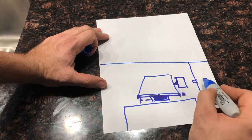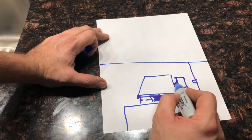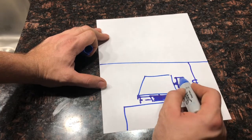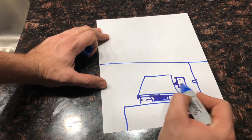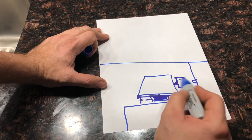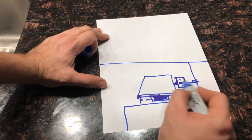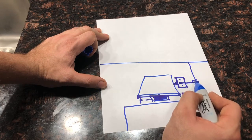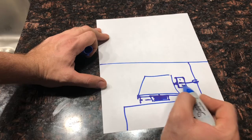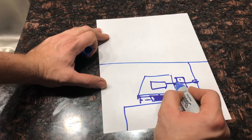And then at that point, to get the measurement, I got the 3 inches here, but I also wanted to find out where it was going to be placed with the speaker. There's two mounting points, and they're kind of off-centered for the height and the base. So I measured on the speaker, got the center line there, and had that center line match up. Then I added up where the speaker drill holes were supposed to go, and I also double checked it with the bracket on the back to match up to where the speaker is.